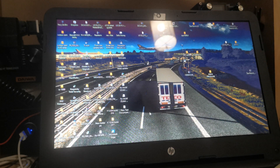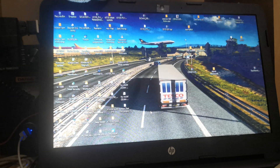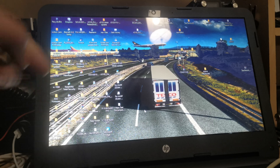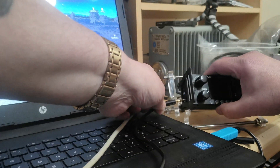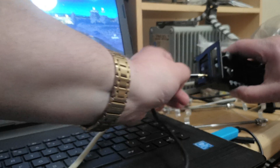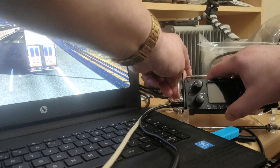So I'm going to close TeraTerm. Then what I'm going to do before I do the head — I'm going to switch the power supply off. Right, that's my power supply off. Now I'm going to remove the USB update lead and plug it into the HID socket on the side of the head.